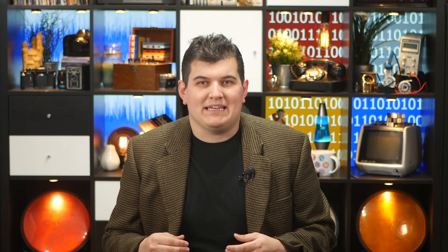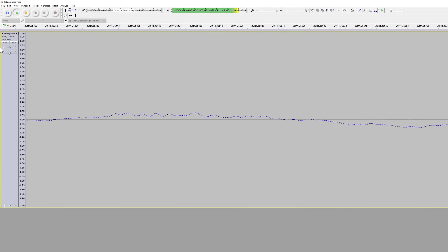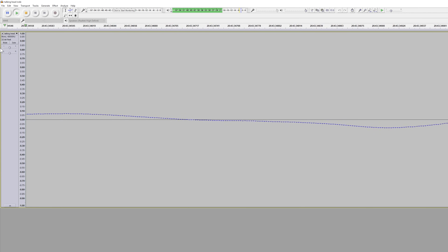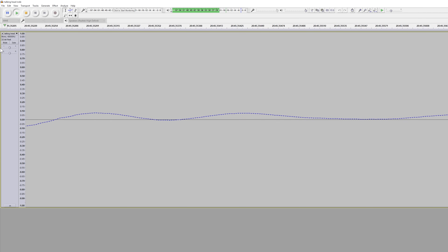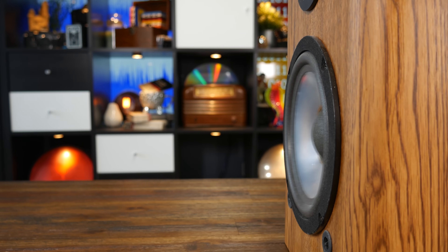To get these numbers back into sound we can hear, we need to use the opposite of an analog-to-digital converter — so we use a DAC, or digital-to-analog converter. A DAC will read the string of numbers and generate an analog voltage based upon their values, smoothing out the choppiness of the samples a bit to make the resulting sound more natural, giving you an analog signal to send into an amplifier and drive a loudspeaker.